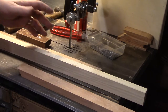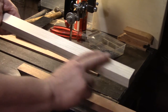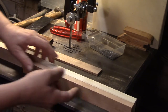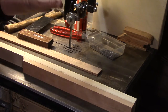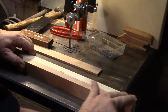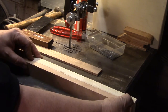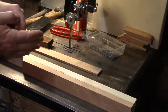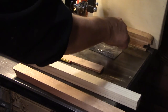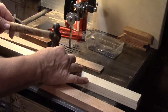If you buy loose timber from me as a neck kit it'll all be planed on two sides, and the important thing is these glue surfaces are planed nice and true. It's a little bit easier if the back strap piece is a bit wider than your neck, because then you can sand or plane it down to a nice smooth finish. If you're using timber exactly the same size you've got to be very careful when gluing so they don't slip. We're going to work on a flat surface and put a couple of pins in here to stop the glue joint slipping.